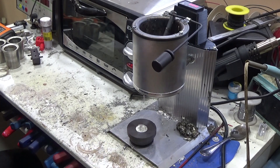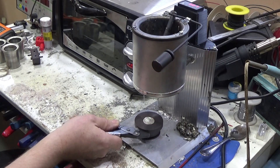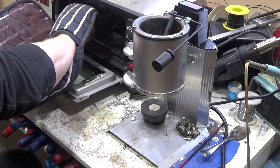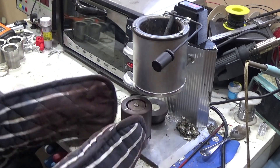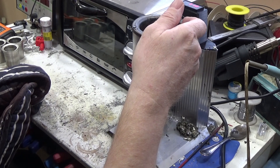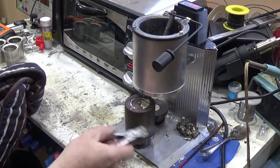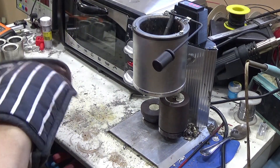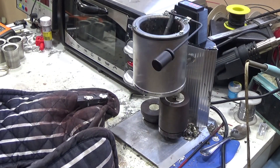I tap it to try to displace any air bubbles. I had to make some air relief grooves, and I know it's full when you start just seeing pewter oozing out the bottom like that. This is the main body of the tankard — it's just filled from the top, there's no special vane for the pewter, I just let it fall on top, hopefully catching the dross. The two part split mould for the handle is a bit fiddly so it has to be held in oven gloves, but it fills easily and always gives a good part.